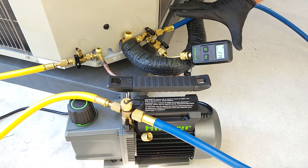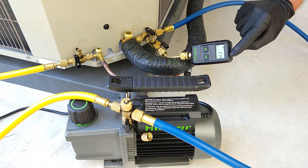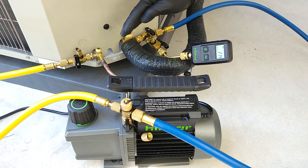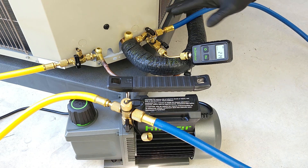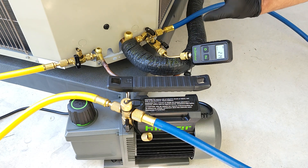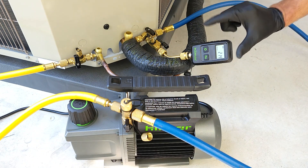The test only rose a total of 14 microns, so we're good to go. That could have just been due to some equalization within the tubing. It's not continuing to rise, which would signal a leak. It's not rising then plateauing, rising then plateauing, which would signal that there's water melting and exerting force as vapor inside the system. We are good to go - we're fully dehydrated.